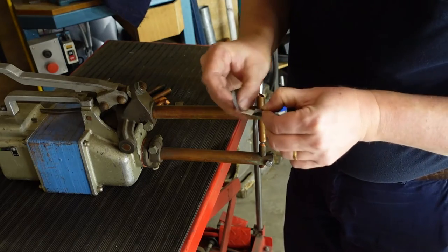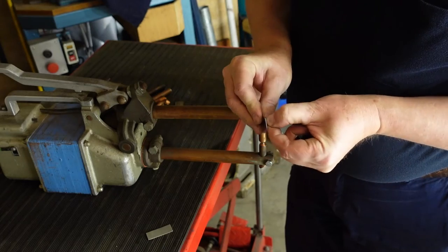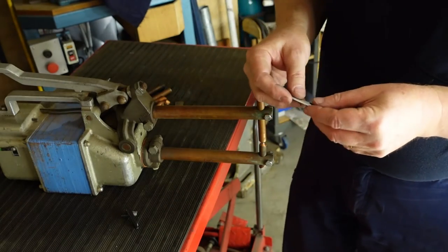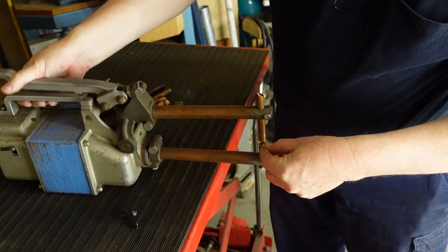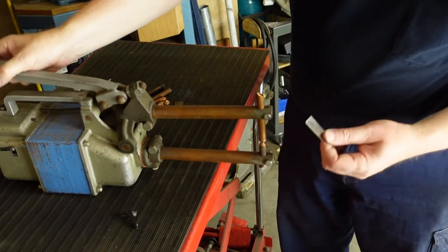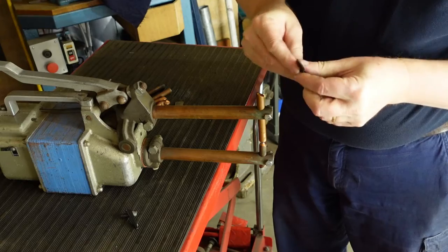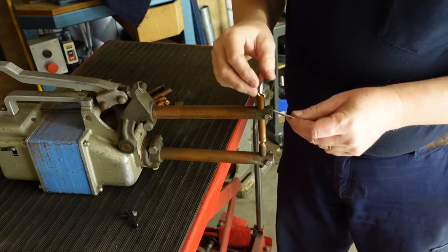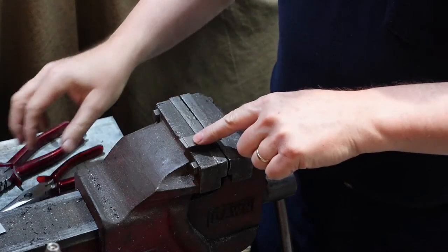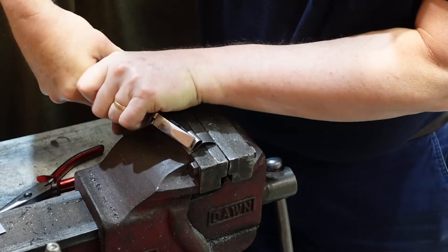Here's a little bit of stainless and I'll do that as well. One of the key things with using different metals is that they have different characteristics. With the plain steel I just gave it one spot, but with the stainless I'm actually going to give it two. I can see sparks escaping there, which means that isn't quite right. It may have just been the edge not being deburred properly.